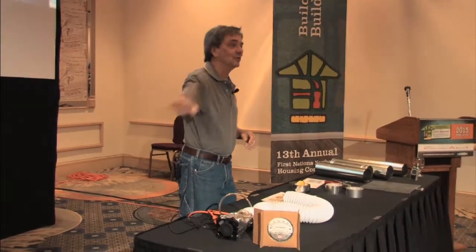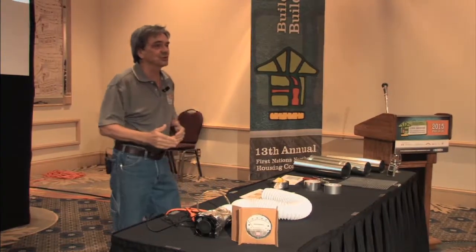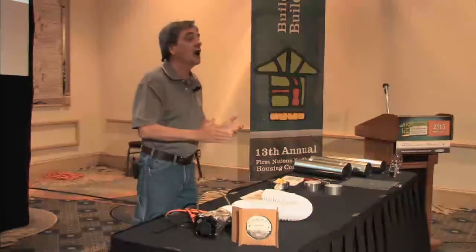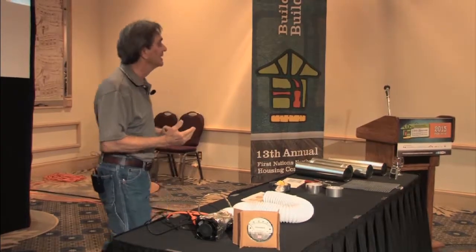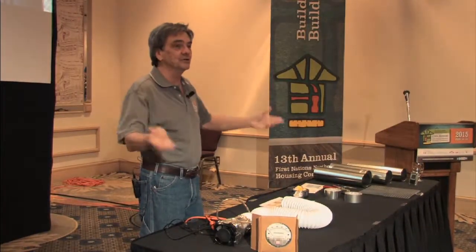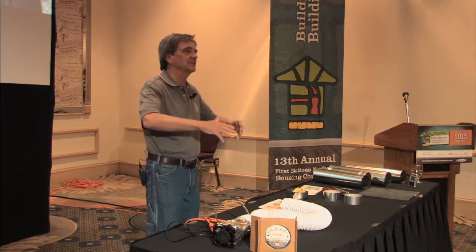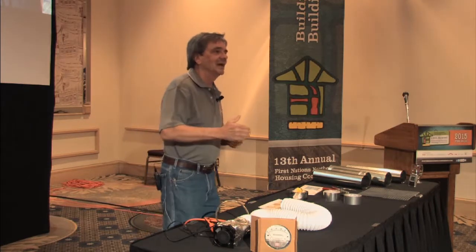And in many houses, they're all electrically heated in Quebec, we get down so dry that we're drying up like old prunes. We talk like this all the time in Quebec because we're down to 20% relative humidity in a normal house. And we're having to add humidity to the house. In many other houses where you have a large population or you don't have proper ventilation, now you're finding out that it's getting too wet. And so the ventilation drops that down. And then the other thing, the permanent solution, is really good insulation of the walls, no thermal bridging, and circulation of air. Okay? Let's get down to the details of really how that works.